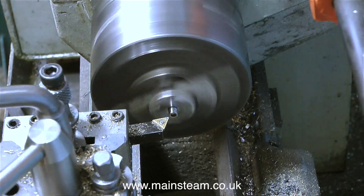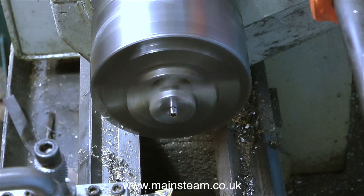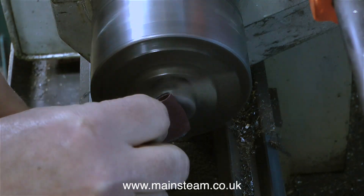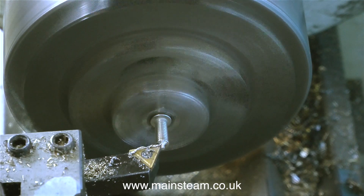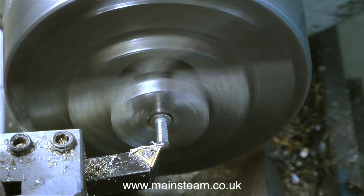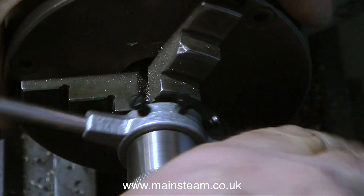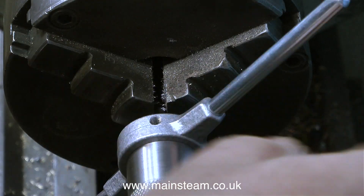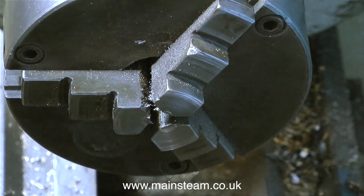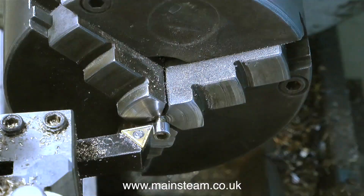A few viewers asked me to run things like this in real time, which I have been doing, but now it's time to speed it up a bit. The high point of this clip is at the end — I used a piece of sandpaper to clean up the sharp edge. Often when I run the video at high speed I see things I didn't notice at normal speed. In this clip you can clearly see the shaft of the bolt bending as the tool starts to cut it — that's because stainless steel is quite a soft metal, well it is until it work hardens. This is the threading process at 400%, that's four times normal speed. To keep the die concentric with the work, it's important to make sure that this adapter presses onto the back of the die holder at all times. And now I can hear the voices starting, but thankfully the job is almost finished.